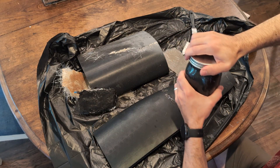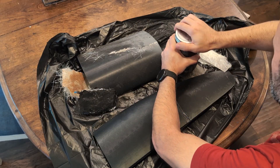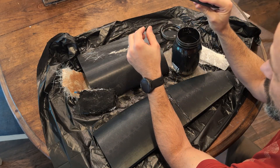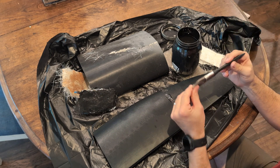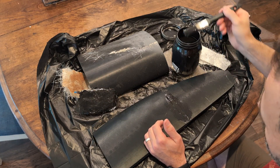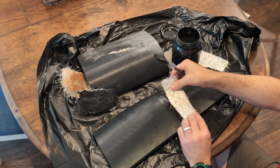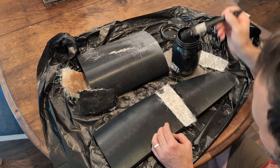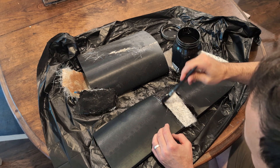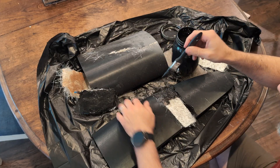We have our slurry and a paintbrush. When you're doing this on a lot of pieces, keep a cup of acetone nearby so you can rinse your brush every once in a while, otherwise it'll start gumming up. We're going to coat this and lay down a base layer, the same way you would resin with fiberglass, and just work it in. With this chop strand mat it's better to dab — if you try to brush it you end up reorienting the fibers. This is a one-ounce chop strand mat.